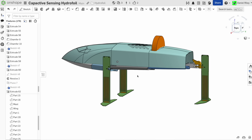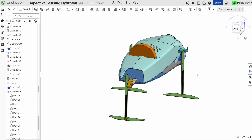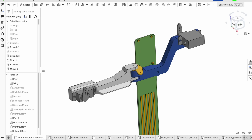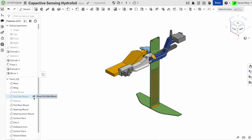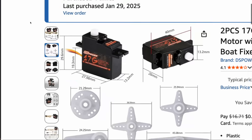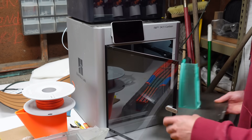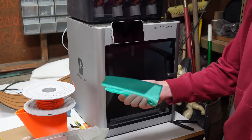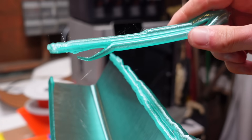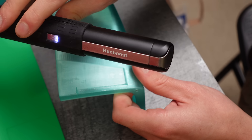Now that it was working well, it was time to build the body enclosure so it looks cool. The CAD files are all available at the Onshape link in the description, along with all sorts of other foil mounts I've designed for various boats — all designed to accommodate these 17g servos. I printed the body shells in 8 sections out of transparent PETG, with organic supports for the thin walls. The propeller is half-concealed in the body, so I needed to cut airflow holes — I used an ultrasonic knife for the first time, and it works really well for cutting through plastic.